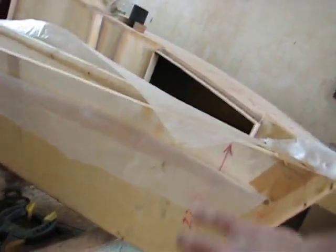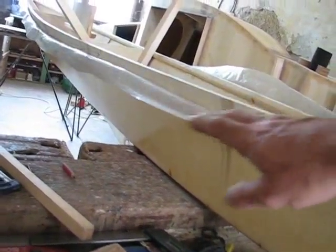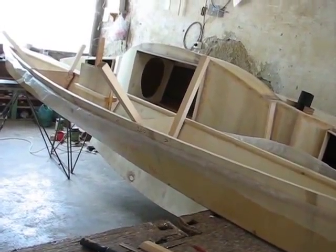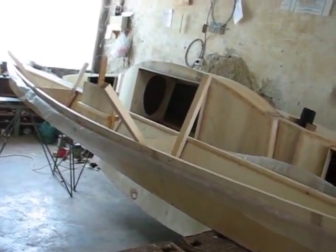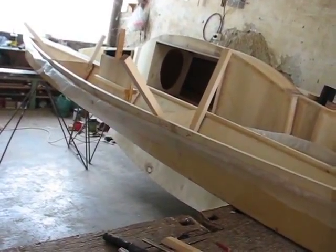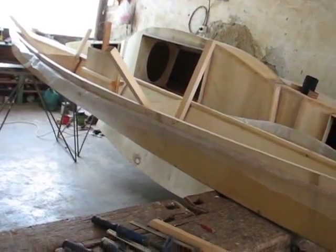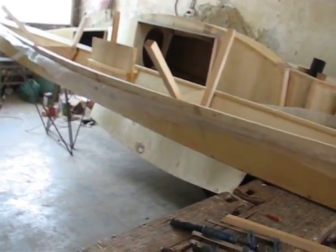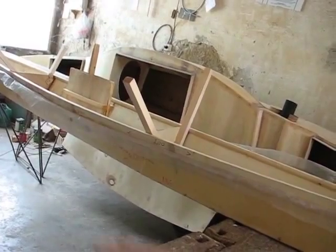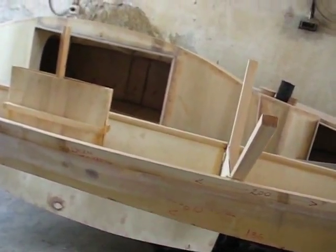Okay, so basically fiberglass the ama up to about 3 centimeters above the waterline. I believe that this ama, according to the calculations, when it's loaded, I've calculated, because I want to have a little bit of drinking water inside the ama, and then like I said, some of our weight will be onto the ama, because we'll be sitting on the bridge deck, and then the bridge deck itself, and then the ama itself. And I've come to about 75-80 kilos under sailing conditions. That's what should be on the ama, and that displacement, 75 kilos, is 14 centimeters draft. So that's where I have 80 liters of displacement at 14 centimeters draft.